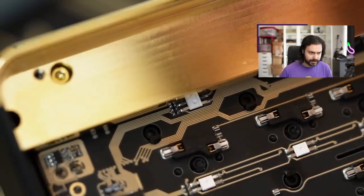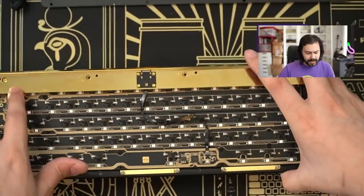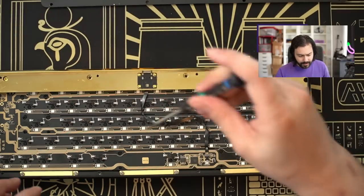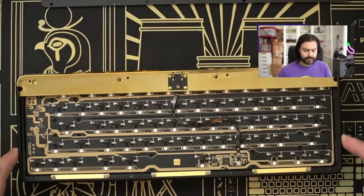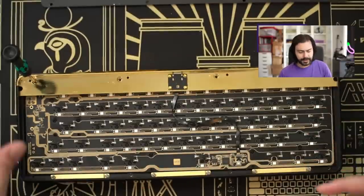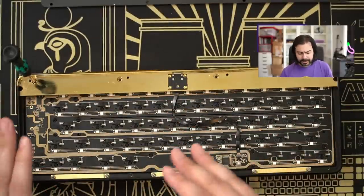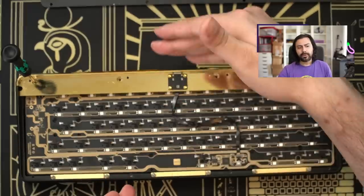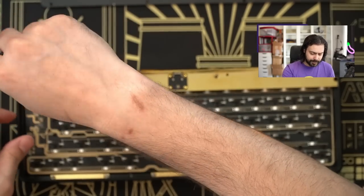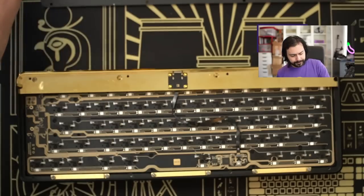So that is an indication that the inside, just the inside, this is not an issue on the outside, the inside edge was not polished enough. So normally after you machine a part, you'll pan polish, you'll sandblast, and then you'll do the finishing. In this case, it's PVD. PVD, I don't know if they do sandblast or not, but the fact that the outside is totally fine, the inside is not, means that the inside was not well polished. This is something that I did relay to Helix, but we'll talk about that in a bit.